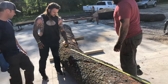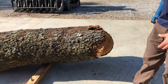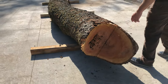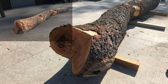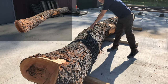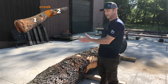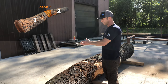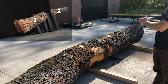We're kind of beginning with the end in mind and prepping the log so that we can get there. For this log, we have the cut that's left over from when they removed the tree. We're going to get a nice square cut on the end of this log, then measure back to where there's a pretty good crook. We want to isolate two straight sections — we found a usable length of wood — square cut it off there, remove a short section in the middle, and get another ten-foot log out of this.